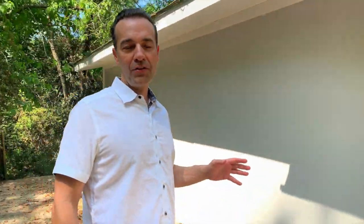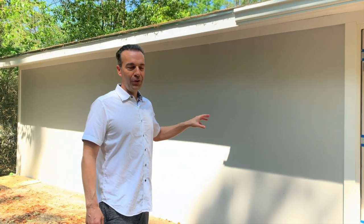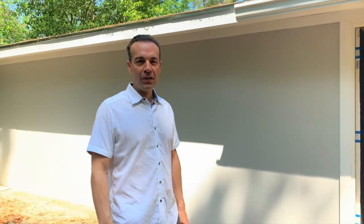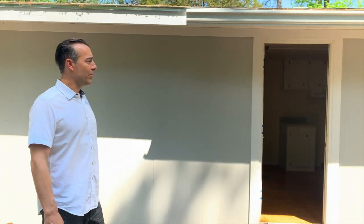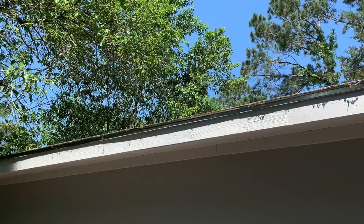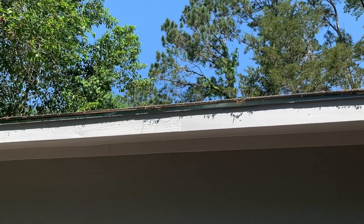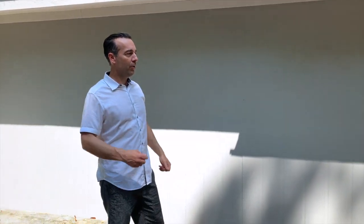Let's check out the siding, the fascia, and the soffit. One thing with rental houses — the more you have, especially if they're wood frame houses, you don't want to be painting those houses every five years. If you get 10, 20, 50, 100, 200 houses, you'll have a whole crew painting nonstop, and we don't want that. This mobile home had cedar siding, which is a problem — the beetles or bees love to drill into it. So we went in here and put Hardie plank siding and painted it. That siding holds paint really well. Also, our windows are metal windows — we don't have to worry about painting them or them rotting. The guys didn't do exactly what I wanted here; part of the fascia is wood, which I didn't want, but I don't want to undo it. I wish they would have put the siding there, in which case we'd have an outside that needs no upkeep instead of a paint job every once in a while.